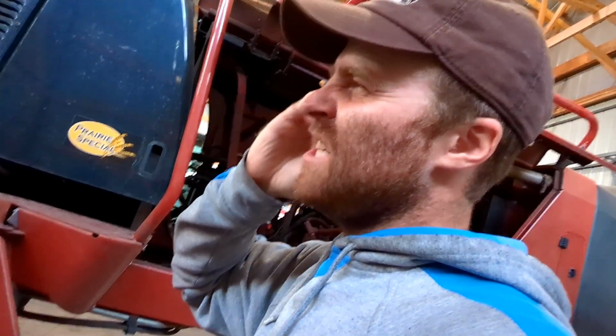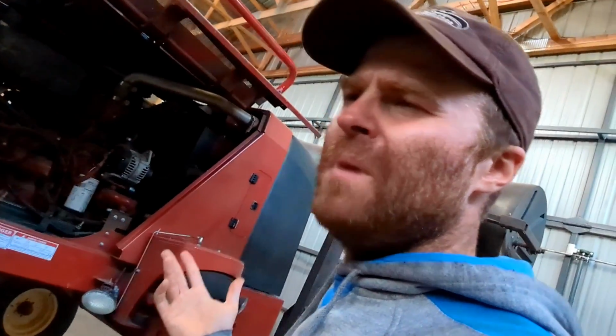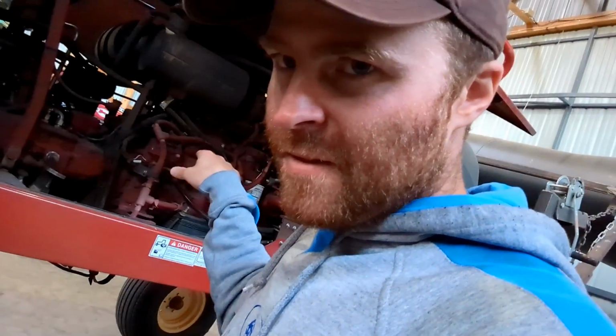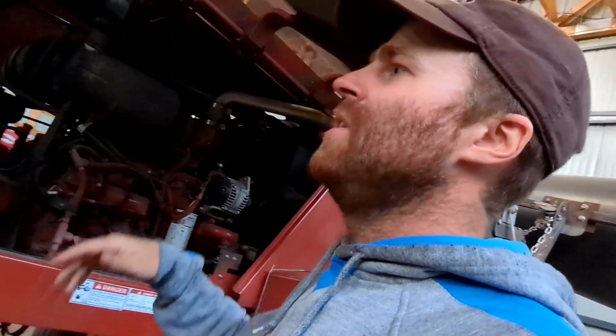Now, when the Draper Head runs, it usually gets around 160 degrees, or I think I've seen it up to 164. Maybe my radiators weren't fully clean, but that was on a hot day. So I essentially dropped the temperatures 25 to 30 degrees. And when this Haybine head runs, on a warm day it gets a little more than 150 degrees on the hydraulic oil. So we dropped those temps quite a bit. And also, fixing those valves on the Draper Head, this thing seems like it has more power, because the leakage is gone and the pressure relief valves are working properly.